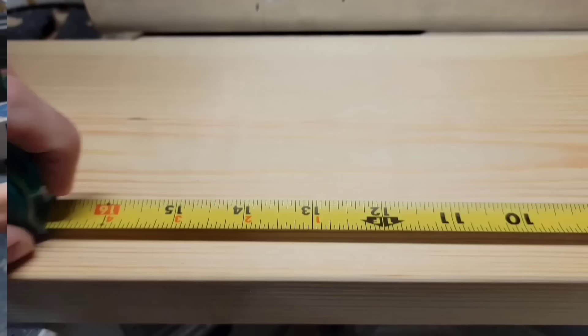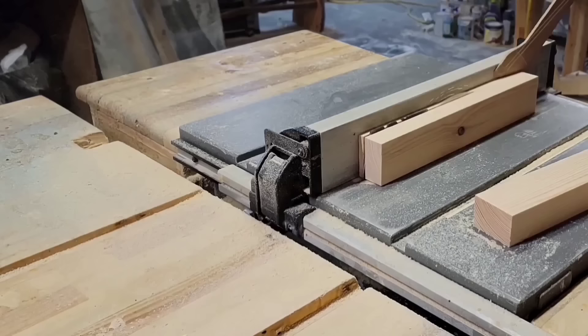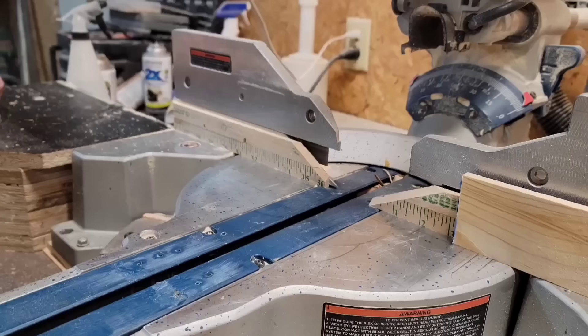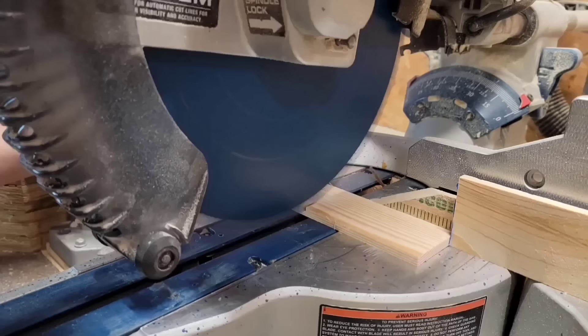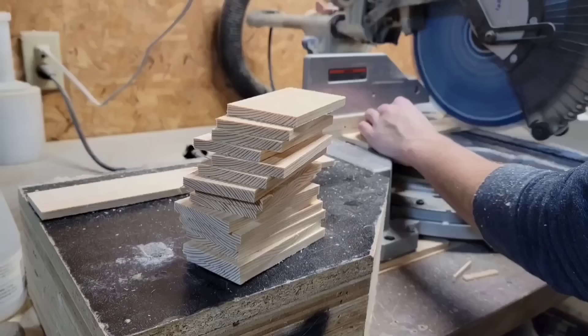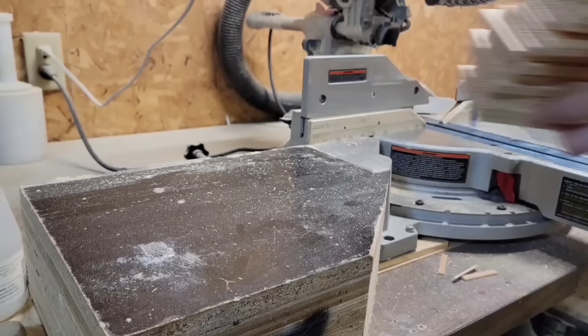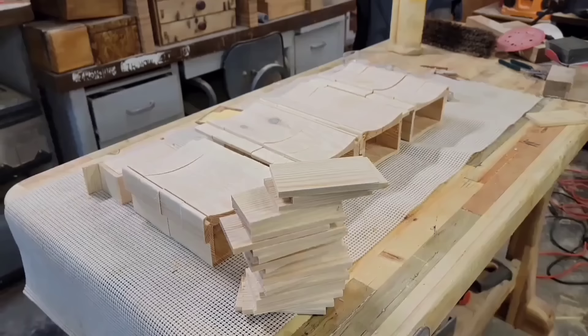The drawers are almost done but they still need bottoms, so I'm going to cut off a 13-inch section from the 2x6 and dice that up to make all the bottoms for each of the drawers. I only need 20 of these bottom pieces, but that 13-inch section ended up yielding me about 24, so I can pick and choose the best ones.